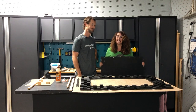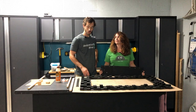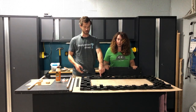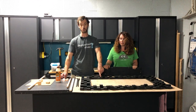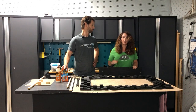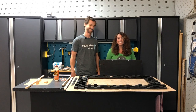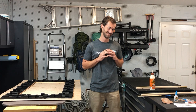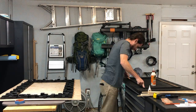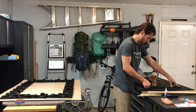Now we're ready for our final step: assembly time. We have our backboard all ready, and Daniel's going to explain how we get the blocks onto the board. We set our inside frame down in place, and individually and meticulously place all of the blocks by hand using a superglue and wood glue combo. For the inside frame, we used quarter-inch hobby boards stained the same black color — half to fill expected gaps between the art and the blocks, and half to keep the blocks aligned when we glued them down.